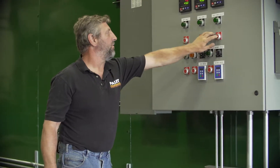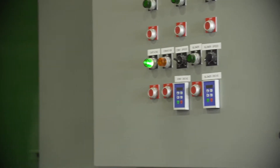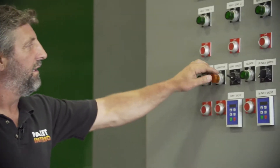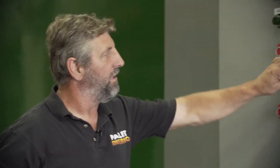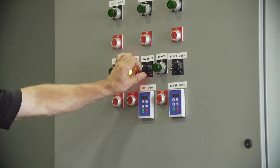Here's your stop for each zone. This button activates your air curtains, which puts the wall down along the pallets that we talked about. This is your conveyor switch — it will be illuminated when it's on. You place your pallets on there and hit the button. You can adjust your conveyor speed very easily right here.